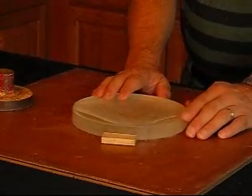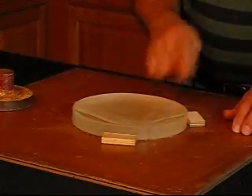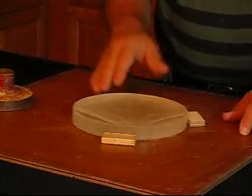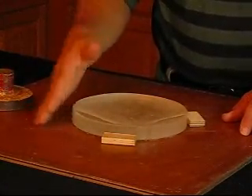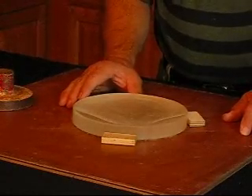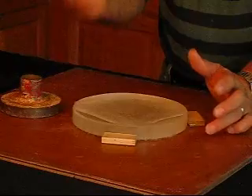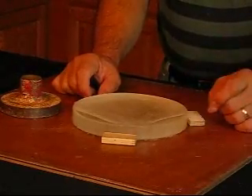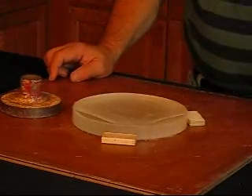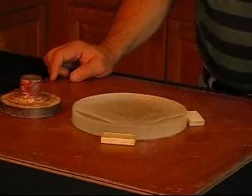The first thing you want to do before you even get started — actually as soon as you get your blanks — you want to put a bevel on your blank. A decent sized bevel, which I've already done. Basically, you take a silicon carbide stone and lots of water and grind it kind of like a file. You want to grind away from the edge and put a nice bevel on it, because it's very risky if you don't — glass will chip very easily if you accidentally bump it against a piece of steel or something. It's so simple to do, but you'll end up with a big chip that will take hours and hours to grind out. So you want to put a decent bevel on it and keep that bevel on there all the way during the whole process for safety.